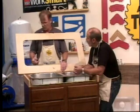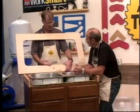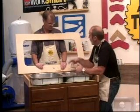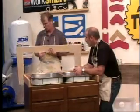We would take that template, we would put the setback right where we wanted it. That would be the front of our cutout. Keep the center line true, and then make the template to the rest of it. And that would naturally leave you room for faucets and things like that. Okay, great. So that's one simple way of doing it.